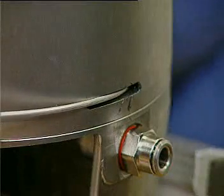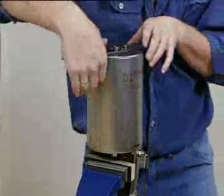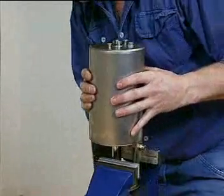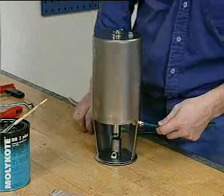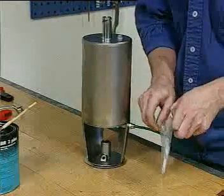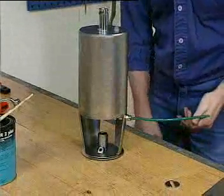Fit the locking wire through the slot in the cylinder and into the hole in the bonnet. Rotate the cylinder 360 degrees. Rotate the cylinder a further 180 degrees to fix the top and bottom air connections on the same side. Prepare the actuator valve assembly by supplying compressed air to the actuator. Fit the plastic ring of the clip assembly on the actuator piston rod. Release the compressed air.